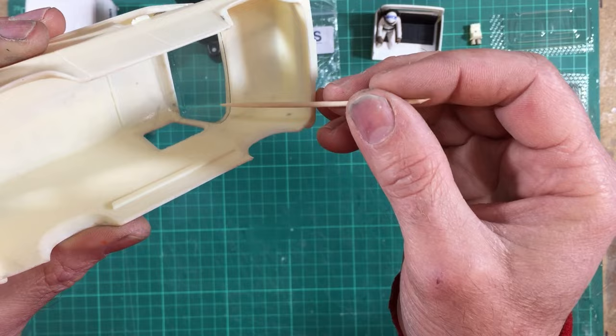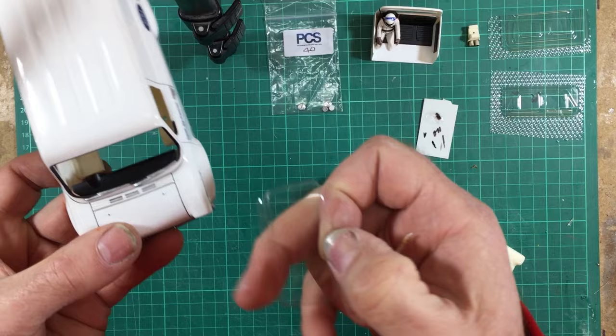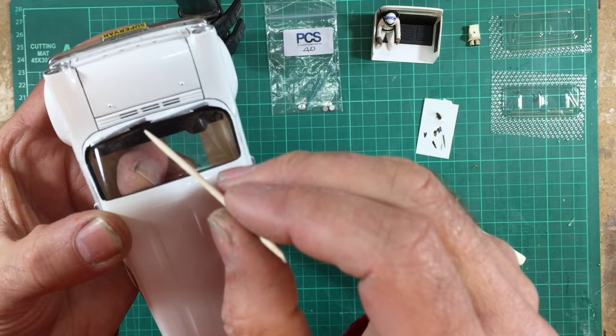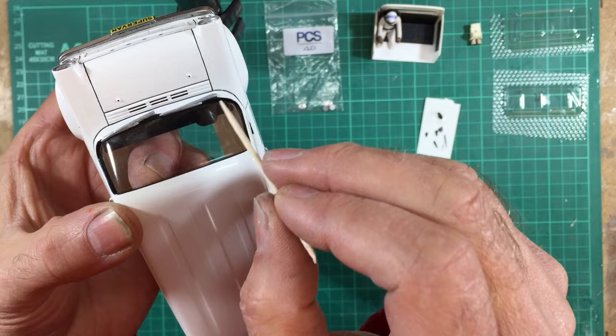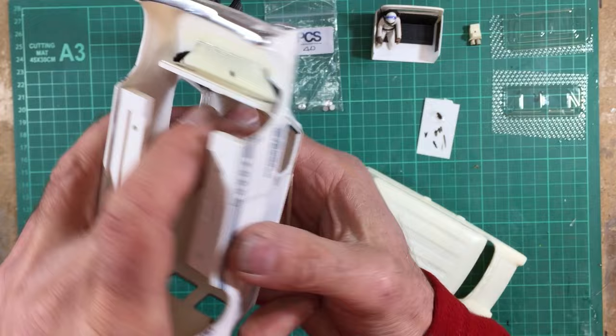And obviously the rest of the A pillar there, because that little angle there, that little tiny return, slips down into the gap that you've created when you put your dashboard in. So when you put your glass in, that little return that I showed you that didn't go beyond the bonnet slips down into the gap between the dashboard and the sill and this panel here. And then obviously your excess goes up onto the roof, and that's all you need to bond the glass with. It's just the excess on the top. And then you get a really nice, perfect fit.